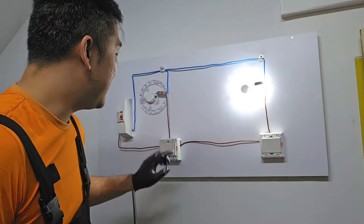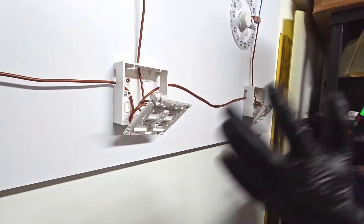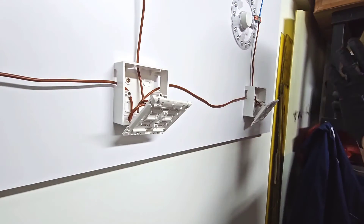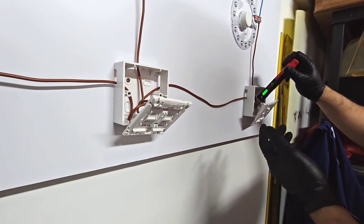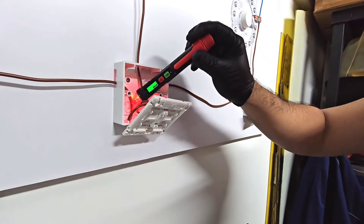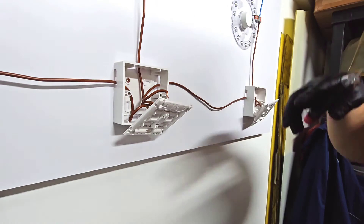What that means is if your switch is faulty, you will not get any current coming out from the line. Another useful thing: let's say you've got two rooms, two different light switches, and you're trying this one and hey, this switch doesn't work, but this switch works. Before you run out and buy a new switch, you can check to see if there's any current running through. So you stick this inside, and there is no current powering this switch — so it should be up the line. Check this one — there's some power in there. So you have to just have a look at the wires. That one isn't even connected, so if this is not connected, you don't get any power through your whole circuit.